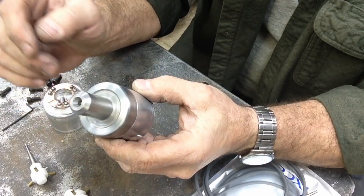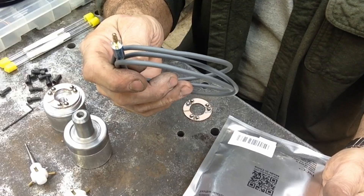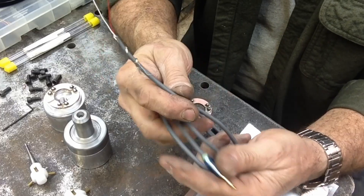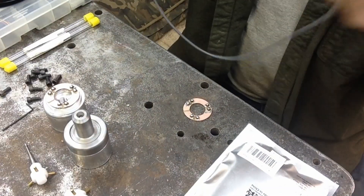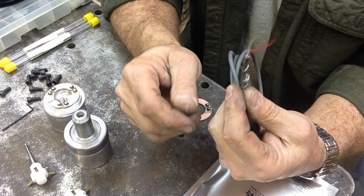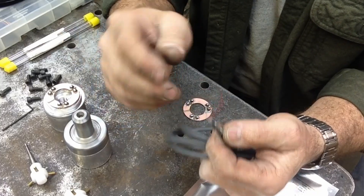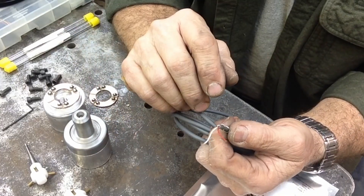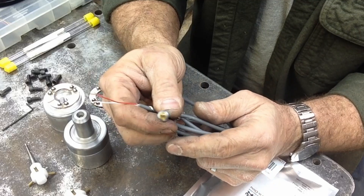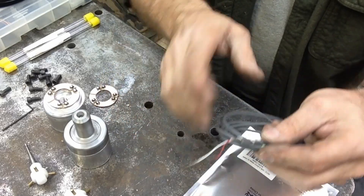I found a nice flexible three-millimeter cable — it's an IXCC off Amazon, I'll put the link below. It was a ten-footer so I cut it to the appropriate length — about three and a half feet for the mill, and I saved the rest for the other probe. I went ahead and already stripped the ends, got the shielding pulled back. I've had them hooked up to the ohm meter so I know which contacts I'm using — the white is the tip, the center collar is the red.